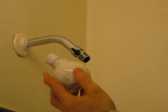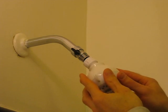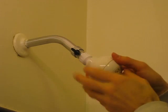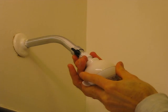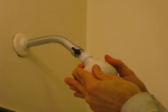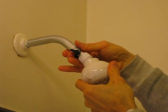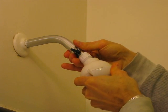The next step is to put on the shower head. I'm going plastic to plastic so I don't need any Teflon tape, at least not according to the box this came in. It's got some plastic so you don't want to use your wrench, otherwise you might break the plastic — don't go too tight. Finger tight like that, and that should be good.